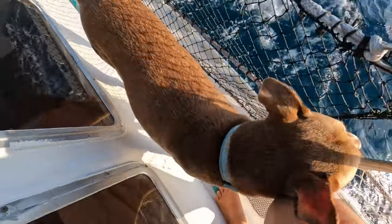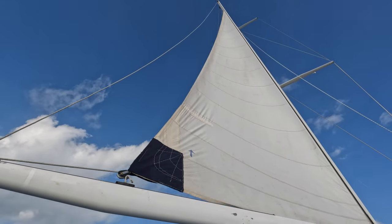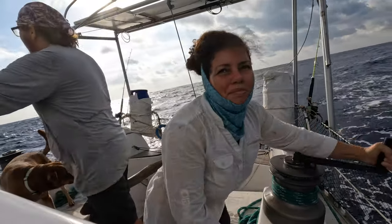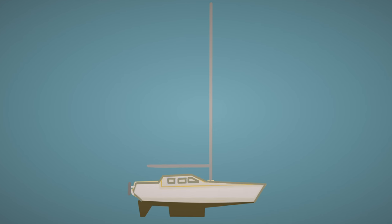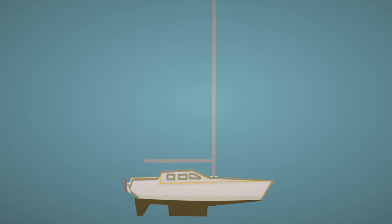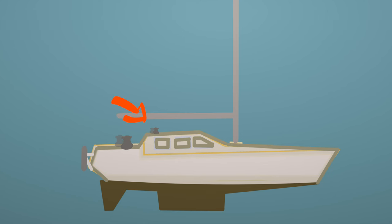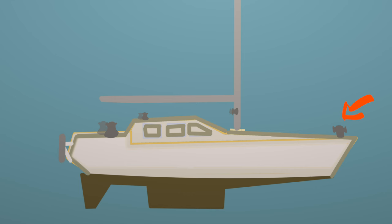We've talked about some specifics in the last two videos, including some vocabulary about sails, lines, and sailing upwind. Now we're going to focus on the helpers, the strength multipliers, some of the simple machines on our boat: winches. We have three sets of winches on our sailboat for three locations that sometimes require extra strength to work the lines. In the cockpit for working the forward sail sheets, on top of the pilot house for working the mainsail outhaul and the reefing, then also at the mast for helping the halyards, and it might also be fair to include the windlass, which brings up the anchor, as a winch.